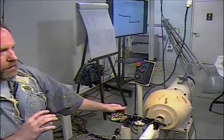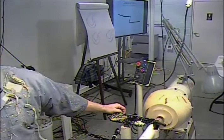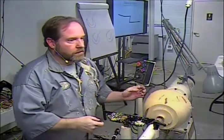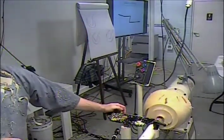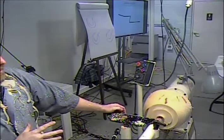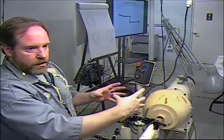jaws. This is the most important part of making this tenon, is to make sure that you have a point that's going to sit completely flat against the metal chuck jaws. If there's any gap in there, when you have this turned around and you're taking all this wood out of the inside, it's a tremendous amount of torque that you're putting on this bowl, it will allow it to flex against the chuck jaws.